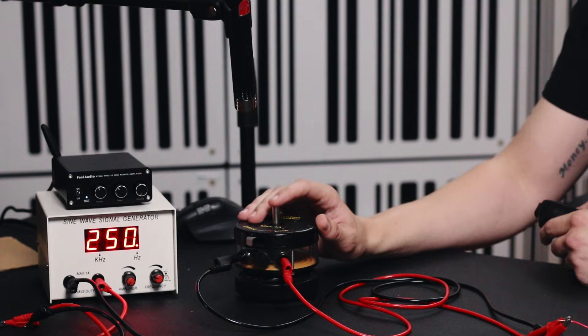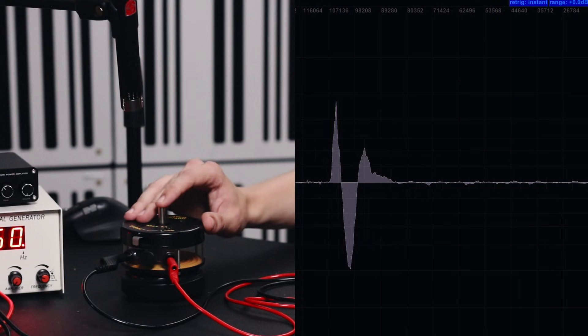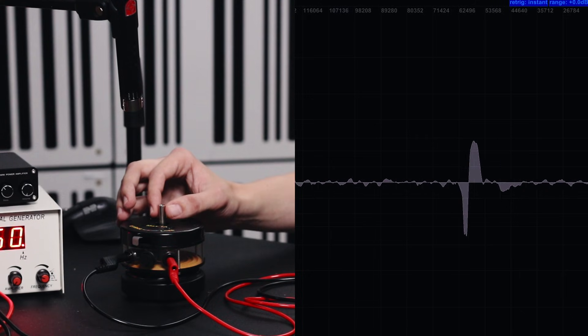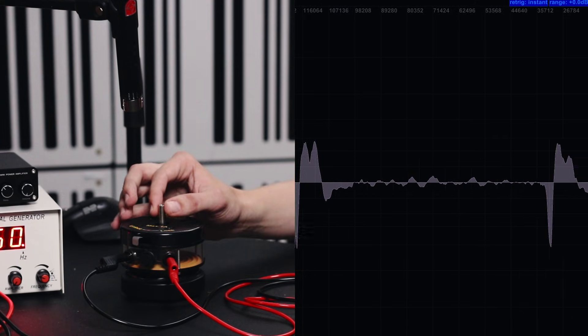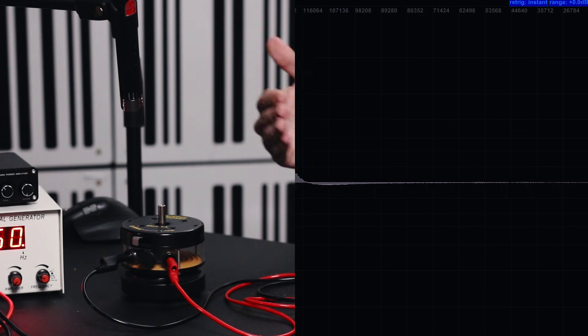It definitely works because I'm able to see it on the input meter and the oscilloscope within the DAW. When I push down on the transducer, we see a waveform that begins with an upward line. When I pull up on the transducer, we see a waveform that begins with a downward line. Notice, though, that when I push down and hold, we only see a pulse that goes upward and then returns to the zero line. And when I let go, it goes downward and then returns to the zero line. The reason it doesn't stay above or below zero is that the current is only generated when the coil moves within the magnetic field. When I push down and hold, the coil stops moving and the current disappears.